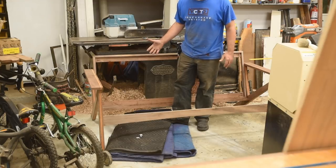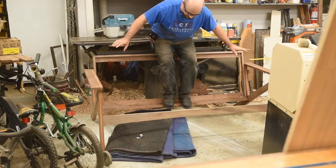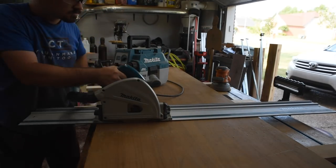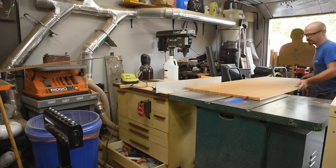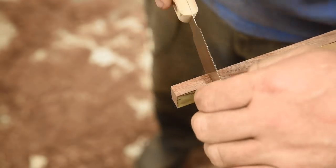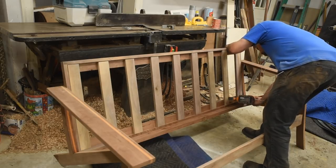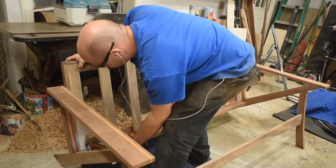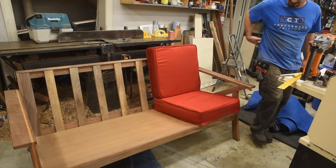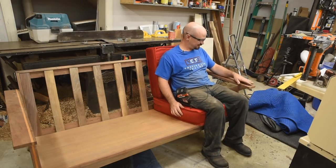For this to be a couch, obviously it needs to hold people. This back piece should be able to hold my weight in the middle or it's not strong enough. It's going to work. If you're wondering what the cushions will sit on, this is it — I'm using a piece of walnut plywood that I'll edge band in walnut. My track saw and table saw make quick work of breaking it down to size, and glue and brad nails handle the edge banding. I install the edge banding long and then flush cut it to fit. The back cushions will fit on slats, so I cut them and then brad nail them into place. My wife actually made these cushions. It fits me perfectly — my feet touch, I don't feel like a kid.